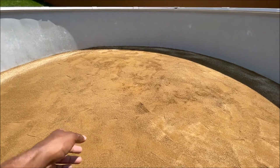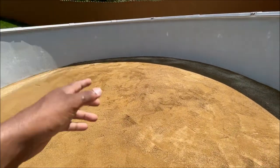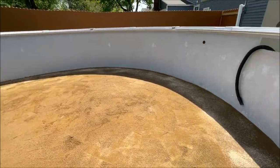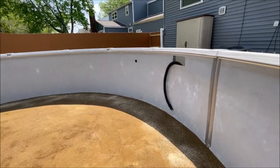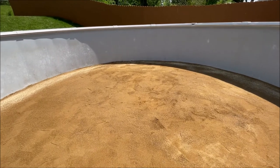I got the vac hose in. So now what I'll do is put the liner here, unroll it, get it tucked in, turn the shop vac on, duct tape off the access openings, and let it start sucking the liner in.